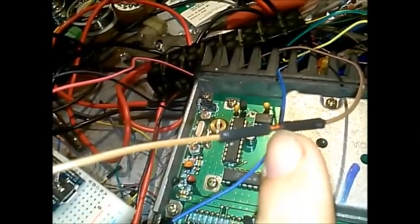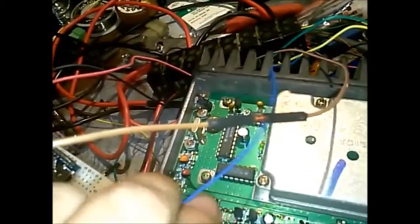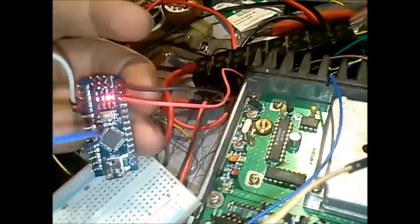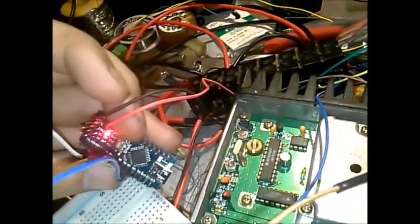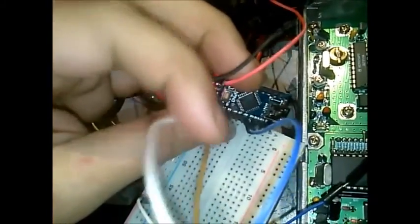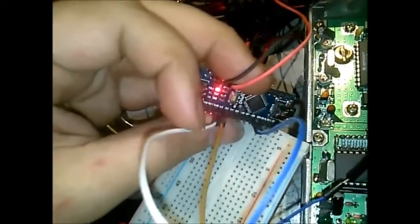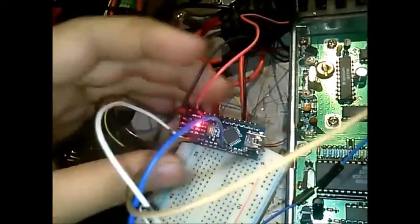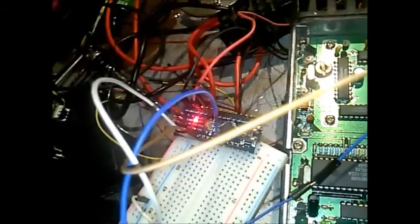Those are the connections in the radio. Put your little zener diode in here to make sure this thing bounces back down and doesn't keep the radio keyed. On the digital pins, your COR is coming in on D2 — that's the little brown wire. This white is another ground. Your transmit PTT line is D8. There is a PTT indicator LED and all that, but I don't have it set up here because I don't need it — I'm using a radio.